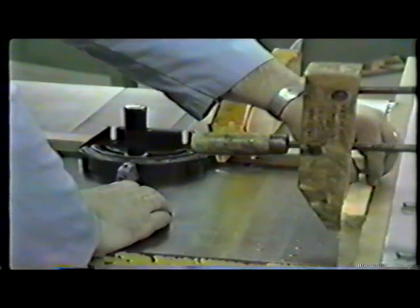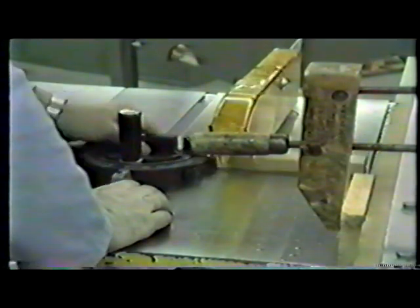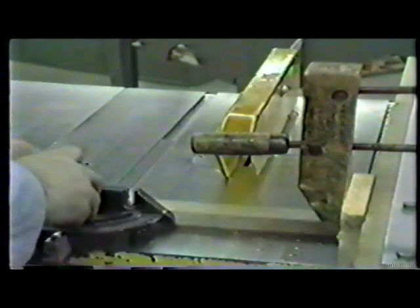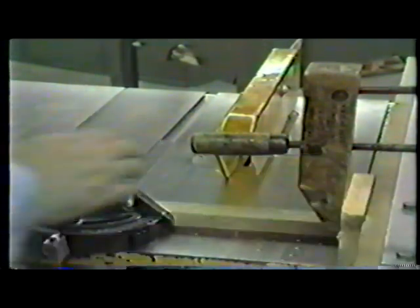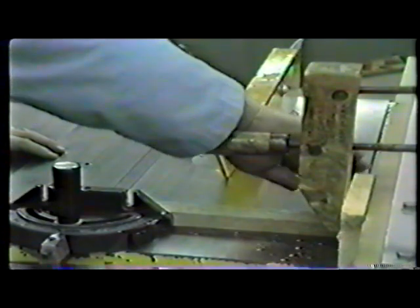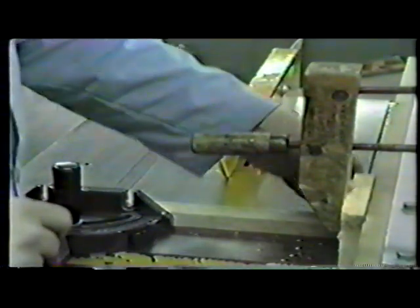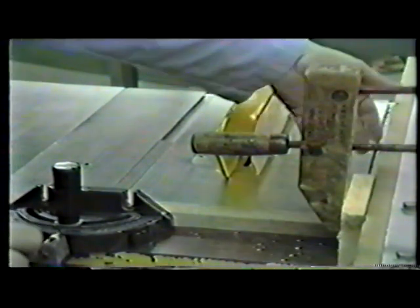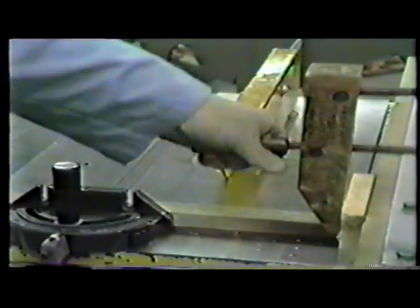Now, because this wood is 3/4 inch thick here, there's a minimum 3/4 inch clearance. And it's perfectly safe and the correct way to do it. Run it up again and cut it. This is only for duplicating short lengths, and you notice that the length of this was called a stop block, stops well before the blade. Wouldn't do any good to take and had a piece of the wood ran up to where the blade is, then it wouldn't be safe because we wouldn't have any clearance. But this is the one time we can use these two together.